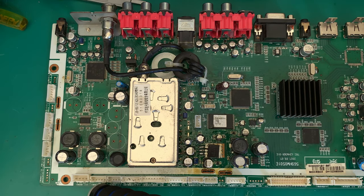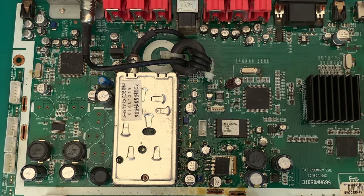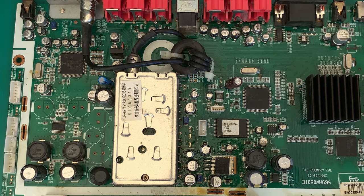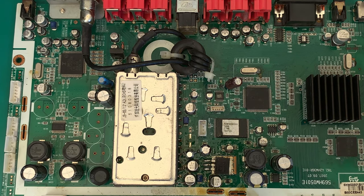work it back. Up here we see a little crystal oscillator, and let's see if I can zoom in a little bit. What you can see, there's two pads missing there. So there was a capacitor that went there, that's gone. And like I said, I have no idea what the size for these things should be, and that means I have to do a little bit of reverse engineering, a little bit of maths to back calculate it to see what the hell we should have.